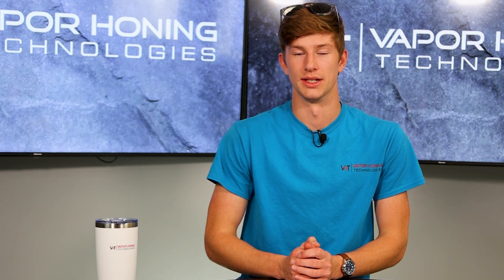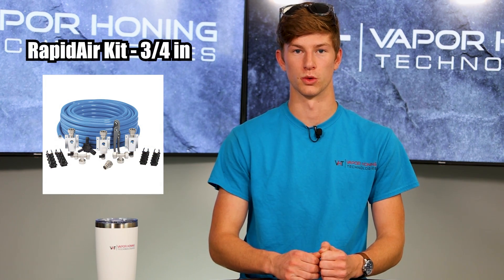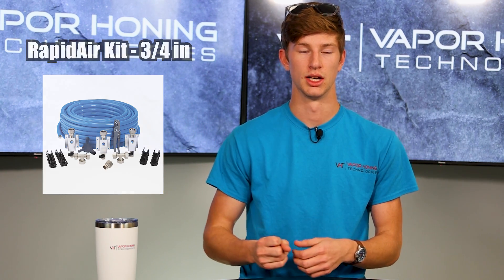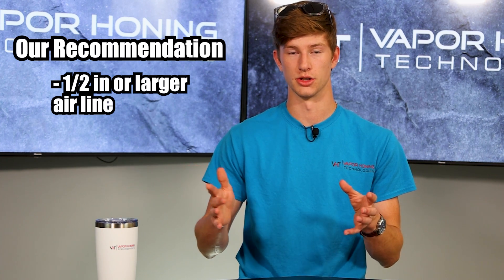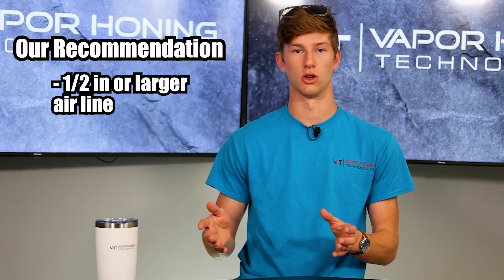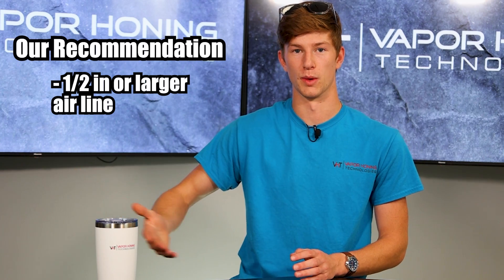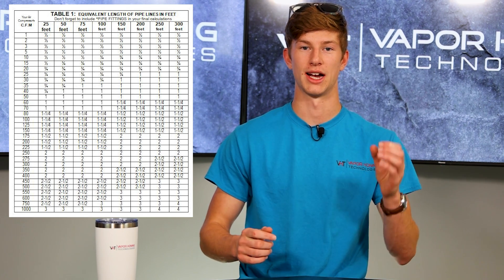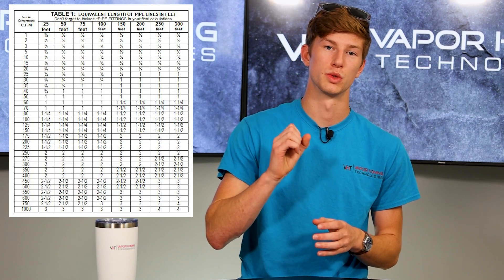One last thing before you go is to discuss the airlines you're running to your machine. In our showroom, we actually use the Rapid Air Kit from Northern Tool. It's very easy to install — it's kind of like a plastic pipe that you can easily bend to supply to your machine. We recommend at least a half-inch airline. If you're going to have your machine around 30 feet or so away from your compressor, definitely use a half-inch if not larger. Do not use a quarter-inch airline unless you're sitting right beside your compressor, and even then we'd recommend using a half-inch. The larger the hose or pipe you run to your machine, the better — not only does it provide a little bit of extra storage, but you're not necking down your CFM, because that can happen. You do have a CFM drop if you're running too small of a line for too long.